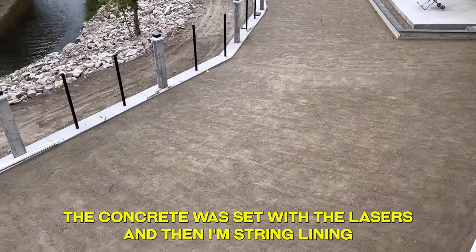A little bit of rain — the river's kind of muddied up a little, but it'll clear up shortly. I've got my liquid rubber membrane down on part of it. I have two cross-lapping, overlapping layers of ice and water shield with waterproofing underneath, then two layers of ice and water that roll all the way up the wall. Then I float the liquid rubber membrane on top — it's almost a quarter inch thick. Then I'll set my tile on this so there's just no way I'll ever get a leak. One-inch-thick quartzite stone will be going on top of all this, including around the entire pool. A little closer every day — a little bit of rain never hurt anyone.